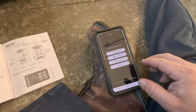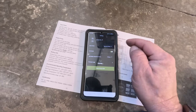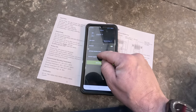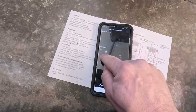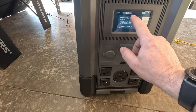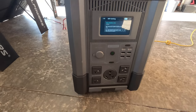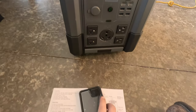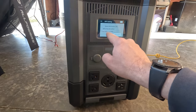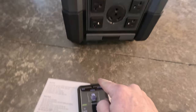Wi-Fi was a lot easier. Choose your account — I went with Google, read and agreed to the terms, hit Google. There's my Wi-Fi device — click on it. It shows offline, and here's where your Eco mode is; you can set it to shut off after 1, 2, 4, or 6 hours. We need to get the Wi-Fi turned back on, enter the password, hit Enter, and connect. It says 'connect' rather than 'connected' — there are just some translation issues here.